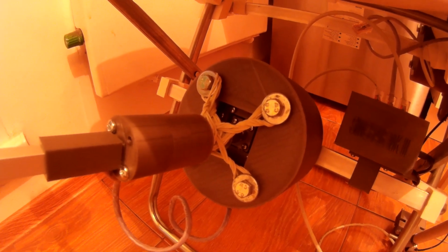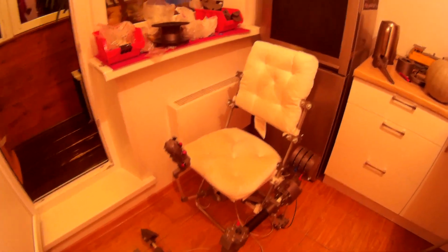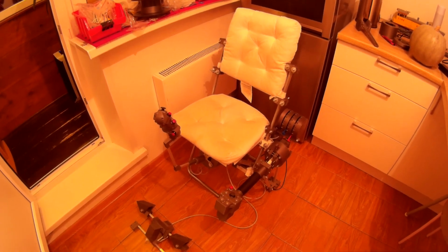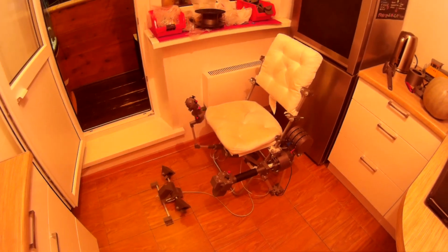You can see the strengthened gimbal with rubber bands, so we have self-centering cyclic. It's really quite cool because the previous version of the gimbal didn't support tensioners of various kinds, like rubber bands or springs or anything else, because these things just pressed out the bearings from their sockets over time. So this new gimbal here addresses this issue.